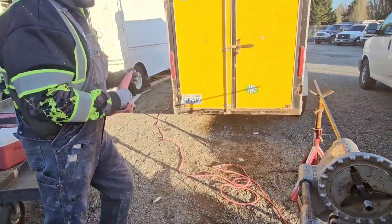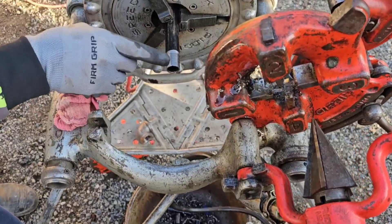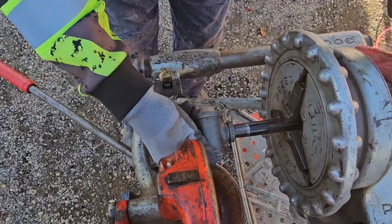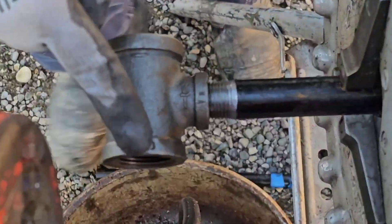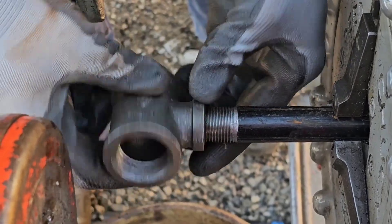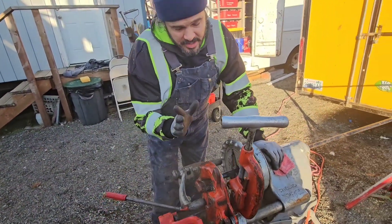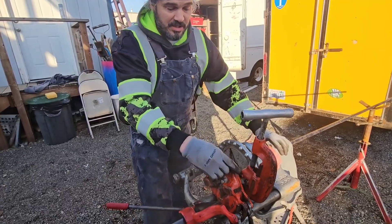Give that a wipe and a test. Looks like I might have to adjust these. I haven't used the 300 in a long time - I just pulled it out and you just saw my first one. I think I'm one thread too much but the fitting will tell me. Just put her on until it gets tight. That's tight. I'm watching for this side right here - there's one, two, three, four, five - five and a half. Too much. We're looking for three.